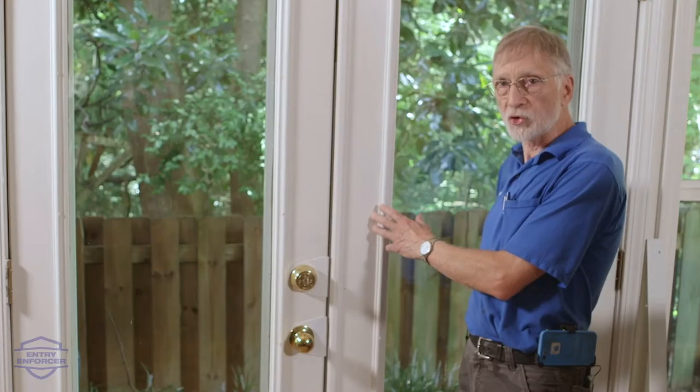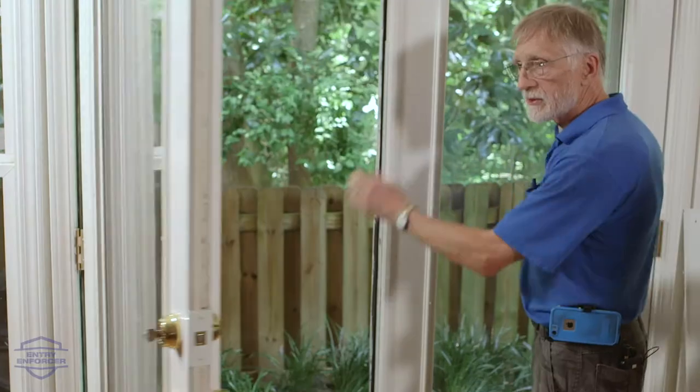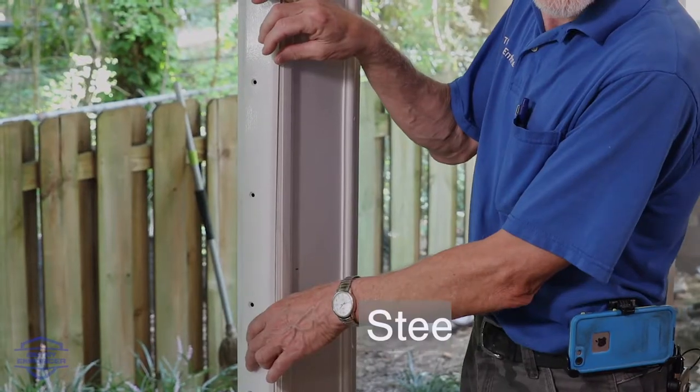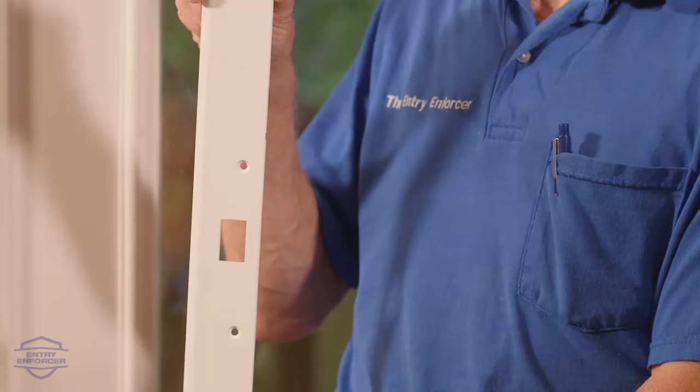Now that the door guardian is barricading the top of the door so it's stable enough, we reinforce all the vulnerable spots with steel — starting with the jamb itself, where we put a four-foot piece of steel and anchor it with long screws, nine of them. Then any force applied to the door gets transferred onto the steel and dissipated.